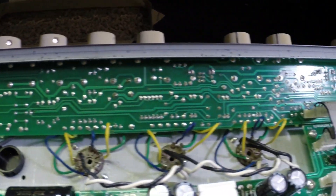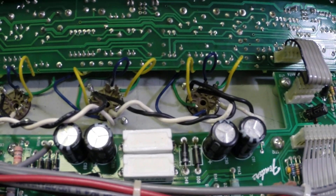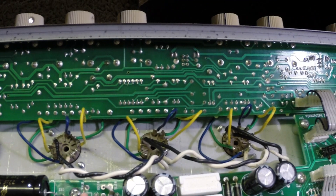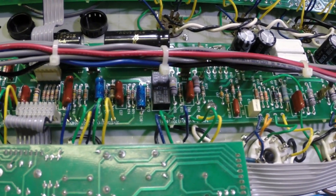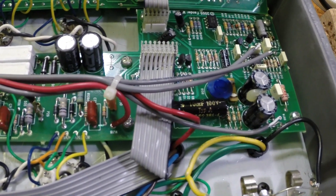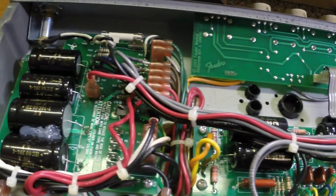Took his front board out and cleaned all the pots. Did some lead dressing up here on the preamp. I was going to do some rerouting down here, but Fender really missed the boat on this one, and I'm not going to spend an hour unsoldering heater leads. Changing a preamp tube and moving some things around up here actually quieted the front down quite a bit. He'd mentioned he was having problems with the footswitch — it would only switch channels when he had the effects loop on. That turned out to be a switching diode for the effects loop. Got that taken care of as well. Bias was changed when the tubes were retubed. Cleaned some jacks too.